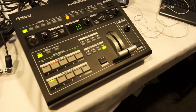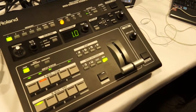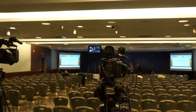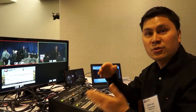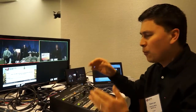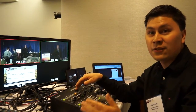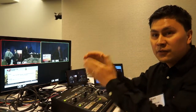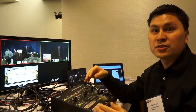It's an entry-level professional video switcher that has HDMI inputs. We're using it with two video cameras connected via HDMI, and we're also connecting a VGA input coming from the presenter's laptop at the front screens. It connects to a VDA — a video distribution amplifier — and we're getting one of the VGA inputs in the back. One of the really nice features of this switcher is the ability to mix both high-definition HDMI video as well as analog VGA. A lot of video switchers lack that, and unfortunately the AV presentation world is still stuck a bit on the VGA standard, so having VGA inputs on an HDMI video switcher is excellent.